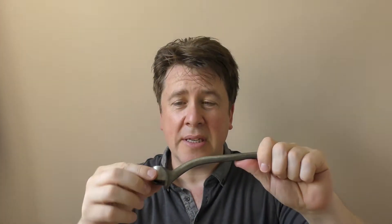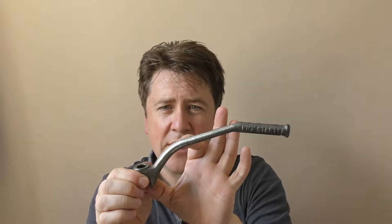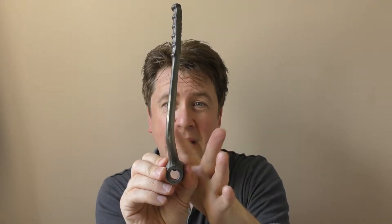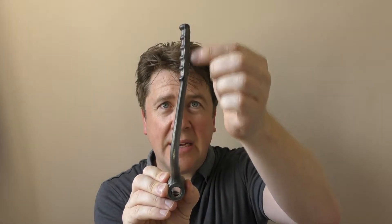My immediate problem is how to model this very organic part — it's a bit of a nightmare. I use Solidworks and I've had several goes at it. I've modeled the shape, put the hole through, and cut that out. This section is about 35 degrees, and then you've got another angle — that goes off at maybe around five degrees — and that is not quite perpendicular with this section, so you can see the problem.